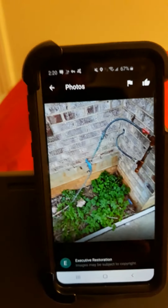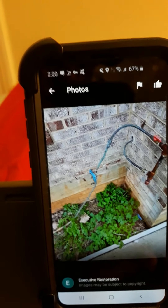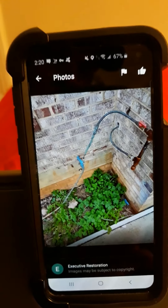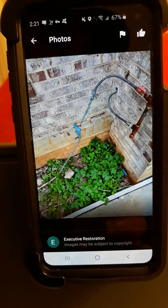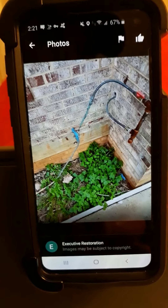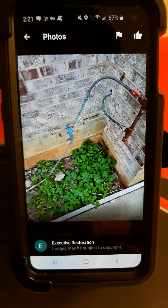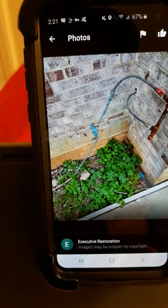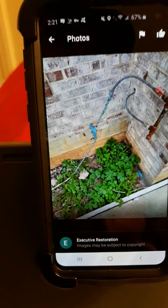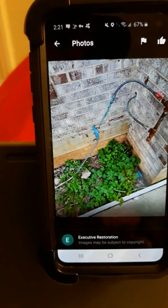Here is a job where the gas line was on the ground. We put the gas line on concrete blocks to keep it up off the ground, because the ground has acidity in it and it will eat up the copper tubing. This is David Snell with Executive Restoration. Hope you got something out of this PowerPoint presentation. This is David Snell with ExecutiveRestoration.com. Until the next video — thanks, bye.